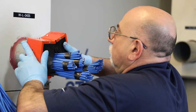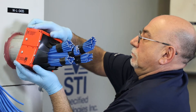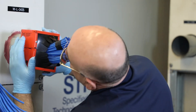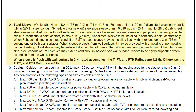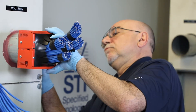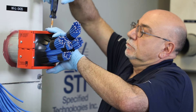Reading through this system, this is going to be for a one or two hour wall. Eddie's putting this thing on already — he's going to have it installed before I even finish reading. Our optional steel sleeve, which we have, can extend from the wall up to three inches. It's extended three inches here, and we have an annular space of zero to one inch around. Eddie's already caulked that with our LCI sealant.